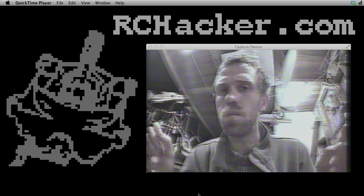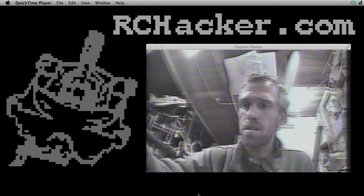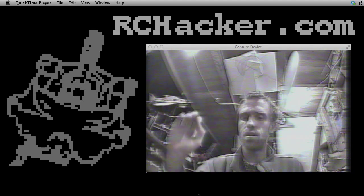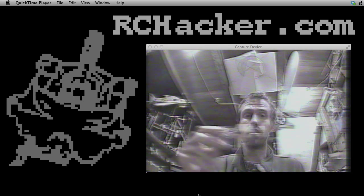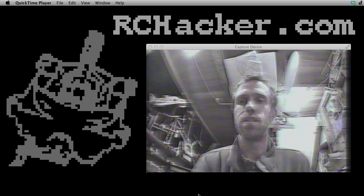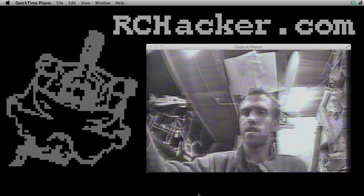So I did a bit of a Google and found, on the 2.4 GHz 500mW transmitter, a post buried way down in a forum that said if you take a resistor and put it between the video signal and ground, that will help match the input impedance on the video transmitter so your camera can properly get a signal across. By default it's something like 350 ohms and they don't have an adjustment pot.